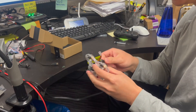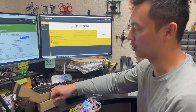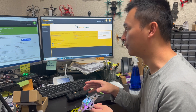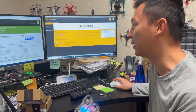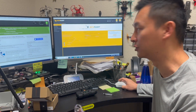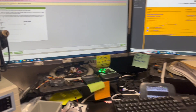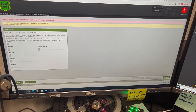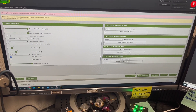The other thing I want to show you is — I know a lot of people prefer to use BLHeli-S. On all our products, the factory default firmware is BlueJay, because I feel BlueJay is better and it also has bidirectional DSHOT. When you connect to the ESC configurator, you can also switch to BLHeli-S or BlueJay — the option is open, you can do it yourself.